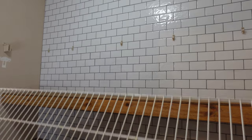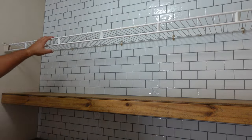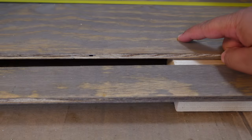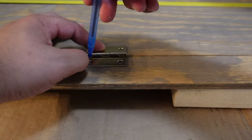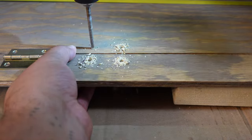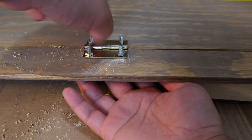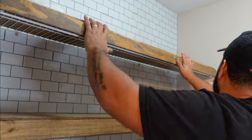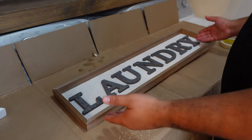We wanted to reuse the shelf that was originally there but dress it up a little bit. We put some plywood on top of it and added a swinging element so we can hide as much of the shelf as possible but still hang things off of it. Bring your two pieces of plywood together and mark where you want to drill your holes. I found some hinges at Home Depot and used nuts and bolts from a previous project. I installed three hinges — two on the ends and one in the middle — for nice balance. With the swing, I can access it to hang things or just hide it when not needed.